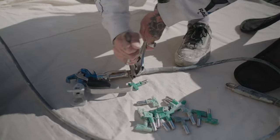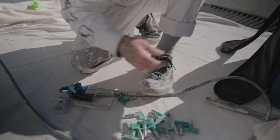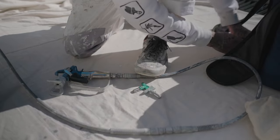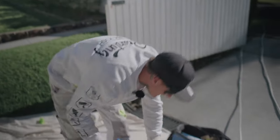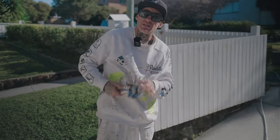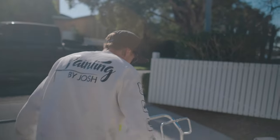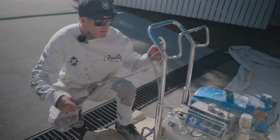Another really important thing is making sure that you've got everything tightened up before you pump that pressure. I've been quite lucky, but I've heard some pretty crazy stories about things not being tightened up, or hoses blowing out because you've got a fitting not secured and it's pierced the hose. So just a very important thing: check all your fittings, make sure everything's nice and tight, because you are under pressure.